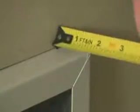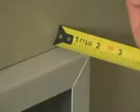The wall sleeve houses the PTAC chassis. It also serves as the mounting platform for both the outdoor grill and the drain kit. In renovation or new construction applications, the depth of the wall sleeve can vary from flush with the outside of the building to a minimum of 1 inch of the wall sleeve showing on the inside portion of the wall.